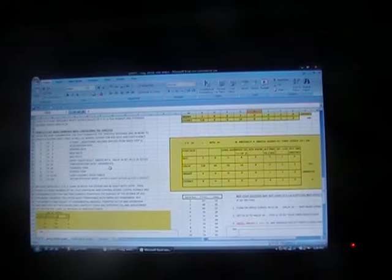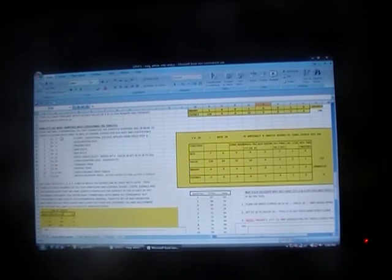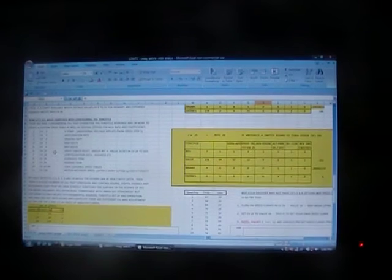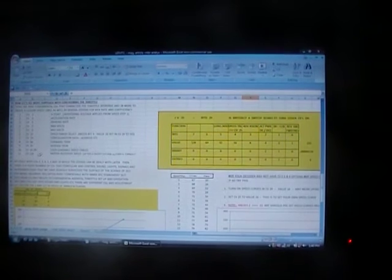And it also discusses, we've also just been through this here, where CV2 was your start volts, CV3 your acceleration rate, CV4 your braking rate, CV5 your maximum volts, which I remember was 192. Your mid volts I think was 90. Your V start, volt start, was 0. Speed tables, that's probably another time and another place. For them to operate, you need to set them and also set CV29 at a certain configuration. Forward trim and reverse trim, we won't worry about those until later on.